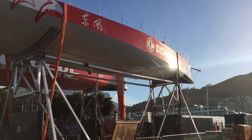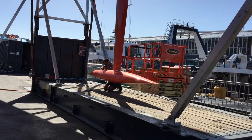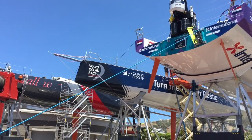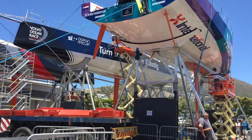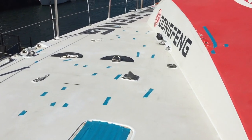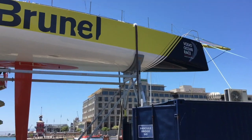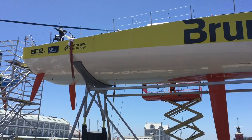The main focus for this week while the boats are out of the water is actually below the waterline, because the boats have a lot of time in the water and they're not designed to be sailed like this — the paint can blister and start peeling off. From a performance point of view, below the waterline is the priority: the keel, the bulb, the rudders, the dagger boards, and the hull below the waterline. After that comes the deck — the non-skid, which is a safety factor — and then the topsides, which are aesthetic and for the sponsors, but lower down the list from a performance perspective.